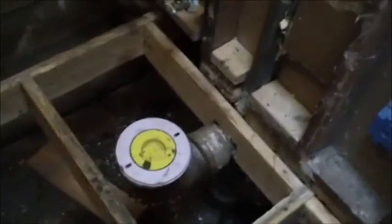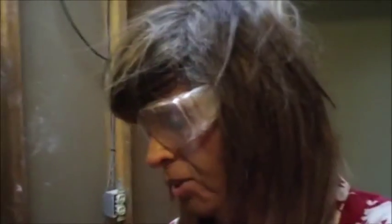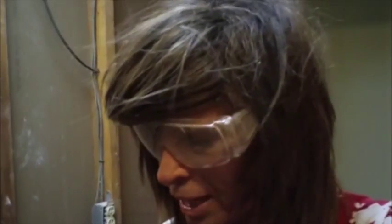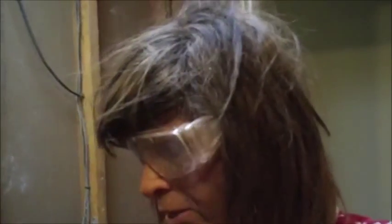So yeah, heck of a day today. A minor disappointment on my part, because I dreamed about having a little bit wider shower in there, but built on the existing base, you're supposed to have 15 inches code clear from each side of the center of the toilet. I may scooch that to 14. I mean, they'll carry me out in a pine box before somebody else has to worry about that.